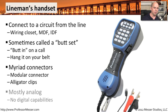These are normally used for analog type connections — a normal phone line or something that is non-digital. Because with a digital type of connection, it's very difficult to hear what's going on and try to make a determination of how to troubleshoot. However, a number of lineman's handsets will work with digital connections like DSL, so you can use the voice side of a DSL line with some of the more advanced capabilities in newer lineman's handsets.